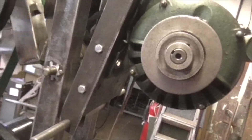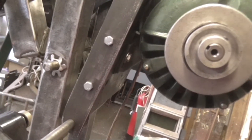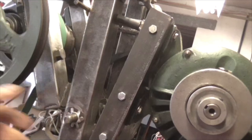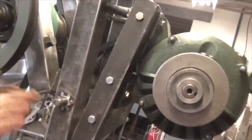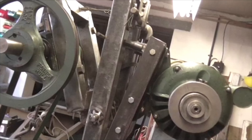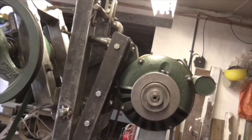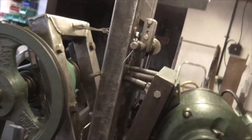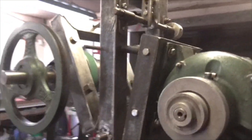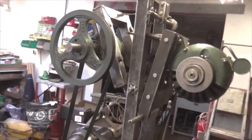This rotates forwards - that's the drive line, that's the slack line. So the jockey pulley would have to be up there if that rotates forwards. Not so easy. I don't know - I'll see what he says. That's it for today. I've got the motor spring loading set and the rubber stop set, and that's worked. I've had a good tidy up. Not a lot achieved, but onward. See you tomorrow.